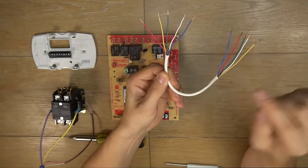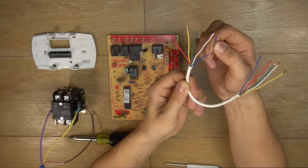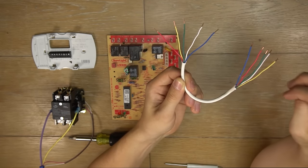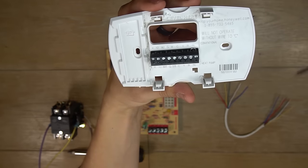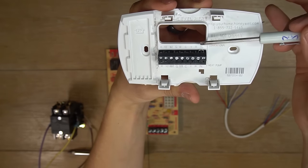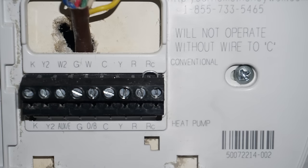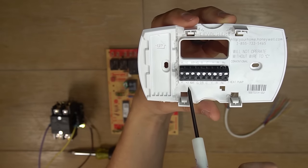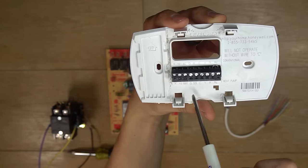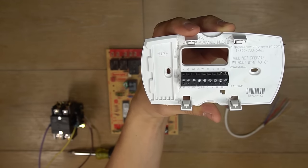So just because this is the standard color coding, that does not mean your thermostat will 100% be wired this way. It's always a good idea when replacing a thermostat to label all the wires and which terminal they were connected to, or just take a picture before you pull them out. Next, we have the thermostat base, which is labeled as well — R, Y, C, W, and G. That's all we're going to use. This thermostat can also be used for a heat pump, so it has additional terminals for O, B, AUX, and E for emergency heat, but we won't be touching those. My setup is just straight AC, so we're only using the five terminals.